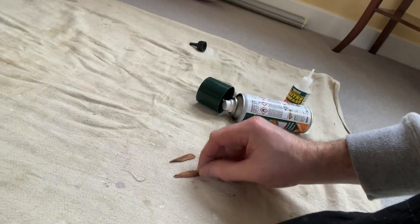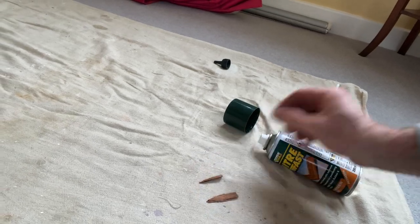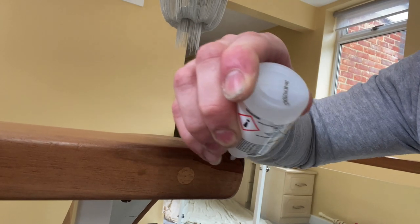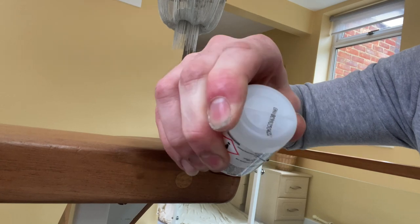Basically it's super glue, so I'll put that on the actual joint on that bit of wood there. Then I'll bring my two pieces of little baby wood which is just over here. That's the way they're facing - face up - so I'll turn them over, spray the activator on the back and then push it into place. Now I'm gonna try and do this on camera and see how it goes. Basically it's gonna put that in the joint where both bits need to go. Make sure it's going right into the joints.